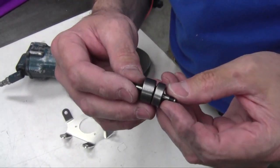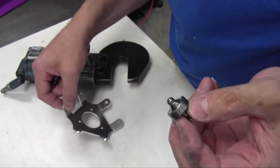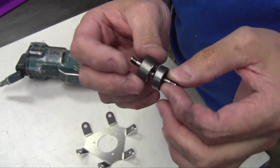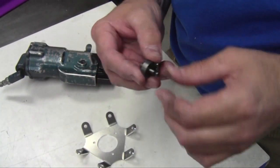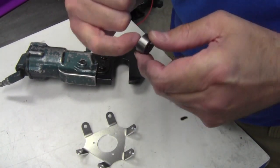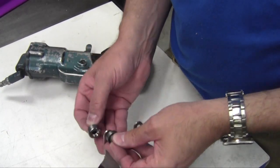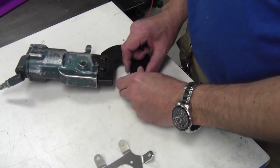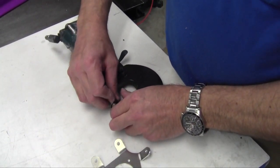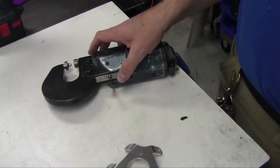Well, here we are over at the dimpling station. This is that die set — this is one of the biggest they make, it's a quarter inch. It's really not made for heavy gauge like this — this is 0.150 5052 aluminum sheet. It's not designed for that; maybe the thickest it would really be designed for is a sixteenth inch, around 60 thousandths. But I'll tell you what, it works pretty awesome. I'll go ahead and put it in my pneumatic squeeze. I know a lot of you guys won't have a pneumatic squeeze, but the shank could be cut off of both pieces and just set in and used in a vise. Gotta grab my air hose.